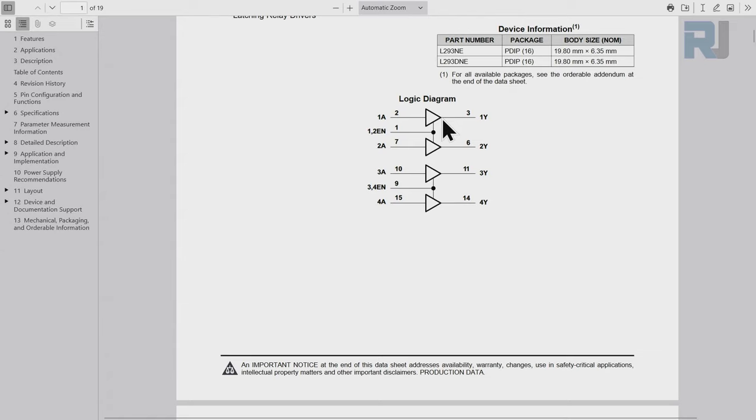Connect a black wire from pin 4 to ground. Then get a wire from the positive red rail and connect it to 5 volts. Now connect the motor - polarity doesn't matter here because reversing it just changes direction. Connect one motor wire to pin 3 and the other to pin 6, with two pins in between. The wiring is now complete with ESP32.